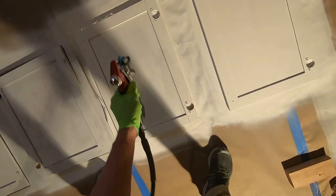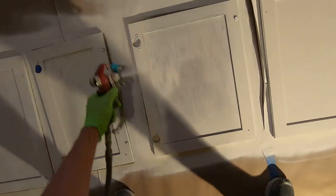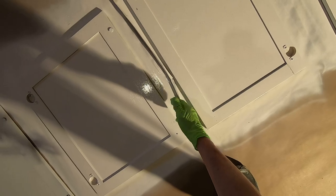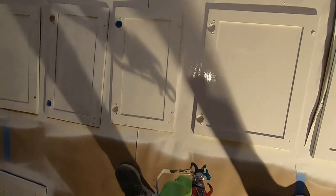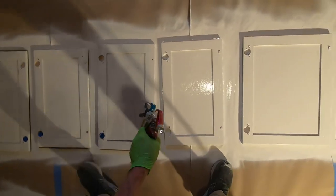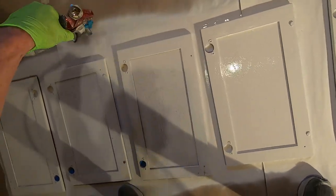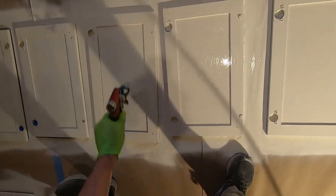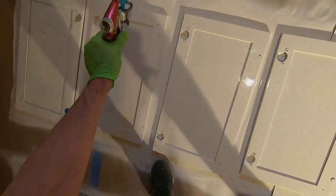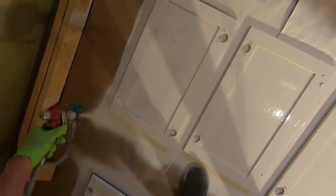Cabinet coat dries in about three hours. If we wanted to put a second coat on these insides, we'll take a look at them. I'm not trying to get real hard on the edges — only getting like three quarters around — but when we flip it we'll do the same thing and get that other edge. You want to be careful about spraying edges — I don't want to blow a bunch of dry paint on this or blow paint on the other doors. So you want to be organized about where your spray is going, and that's why we laid these out. If I get a little paint on that one when I'm spraying this one, I'm right wet into it — no big deal.